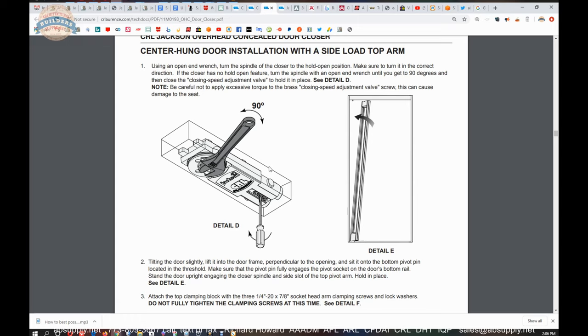In conclusion: this is a brown body — it looks dark but it is clearly brown when held against something black. The latch valve is closest to the end, and the closing or sweep valve is the next one over. There's no spring adjustment because this is a fixed regular spring, and no back check either. The client is replacing existing units. The end user confirmed 105 degree hold open, door size 3.0, regular spring should be fine. The purpose of this video is to show you this closer and broaden our exposure to the world of this closer both past and present.